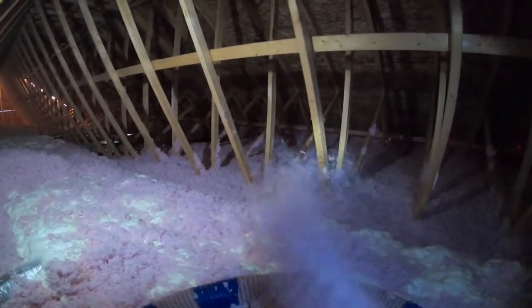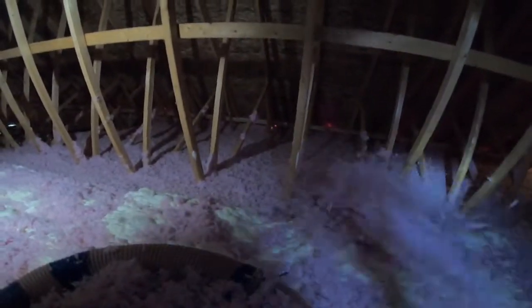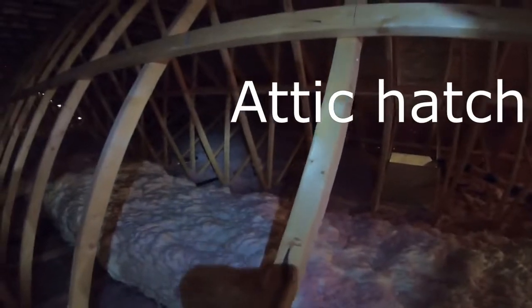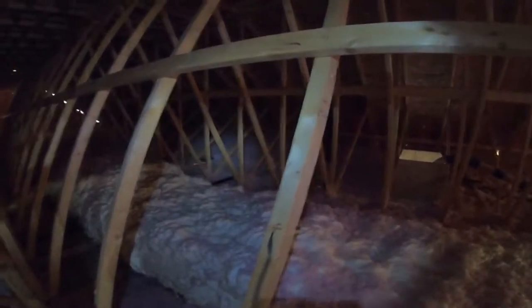Right here is a nice position to finish off this area because I'm parallel with the truss cavities — I can compare from truss to truss. The insulation just falls right onto itself, and I can compare the truss level to make sure the insulation crosses the trusses at the exact same spot so my depth is uniform. I've made my way across again, now closer to the edge, finishing off this side. It's typically always best to insulate parallel with the cavity.